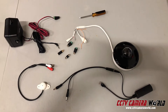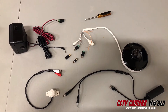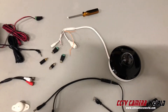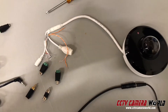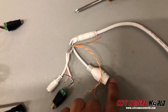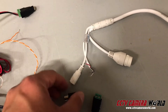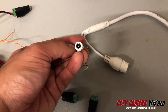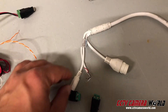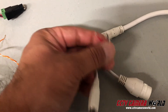In this video I'm going to show you how to connect our two-way audio kit to our pan tilt zoom cameras, also called PTZ cameras. Here's a mini pan tilt zoom camera that I've got and it has three connections on it: an RJ45 which is for POE, a 12-volt connector which you won't use unless you're doing this process, and these three lead wires for audio.